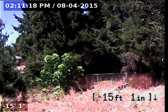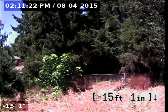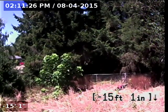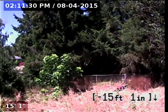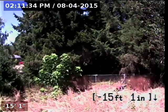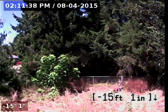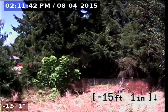Also, the last 6 or 7 feet of cast iron that's underneath the home, eventually that's going to need to be replaced. It looks like there was a little bit of a clog there, causing some water to back up into the line, so maybe just recommend running a lot of water or maybe even a jetting of the sewer line to clear all that out, to make sure that it doesn't get worse or the water doesn't continue just to sit there and erode away the line.